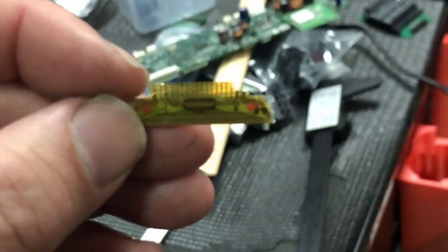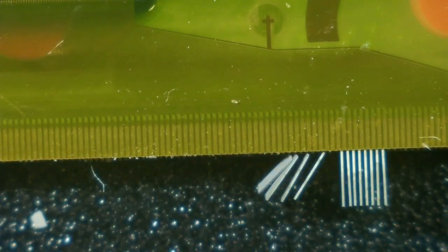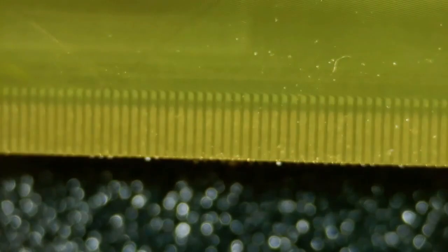Let's take a look at this component inside the Epson print head at 18 times magnification. The microscope is great for soldering components. When you need to reverse-engineer a component, you can zoom in, lower the monitor, and get this detailed internal structure. On the top is a power distributor decoding which nozzle to fire. The silver rod fires each individual nozzle. You need to zoom in to figure out which wire is the signal wire, which one is the ground, and which one is the positive VCC. I used to have an optical microscope and a dissection scope for this work — I'd use the dissection scope for circuit board repair and switch to the optical microscope for investigating internal structure. However, I couldn't smoothly scale like this, because the optical one has fixed levels: 50x, 200x, and 1000x. This one is continuous.